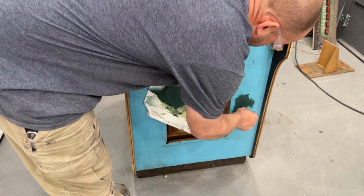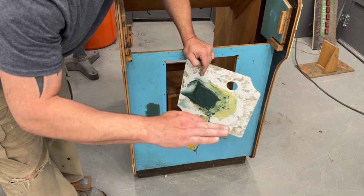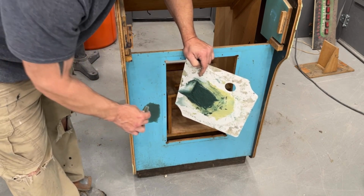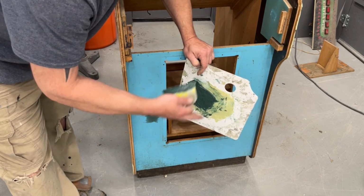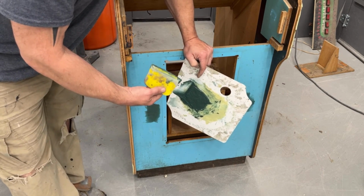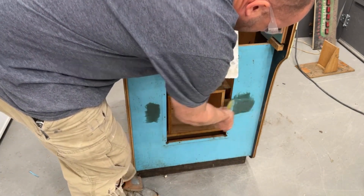The reason why I like to use this on these holes is it tends to bond over the dowel rod and the wood around it. So it kind of puts like a coating over top of all of it. And it doesn't shrink. Like if we just put regular Bondo on here, chances are in a month or two, you're gonna see a ring in your paint where that dowel rod was, because that regular Bondo will sink in. It'll shrink and you'll see that ring. This stuff is kind of like bonding over the surface, and having that short strand fiberglass in here, it's like you're sticking a piece of laminate over top of it, spanning over it and filling it in. So I definitely recommend using this stuff for stuff like that.